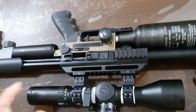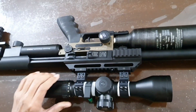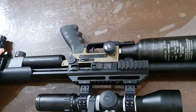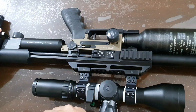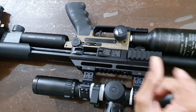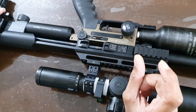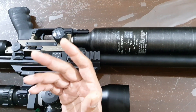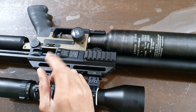This is one upgrade I had not shared before. I observed that the gun's first regulator, which runs at 150 to 180 bar, was showing fluctuations of 10 to 12 bars without any reason. So I opened the first regulator, polished the belleville washers, and addressed the issue.